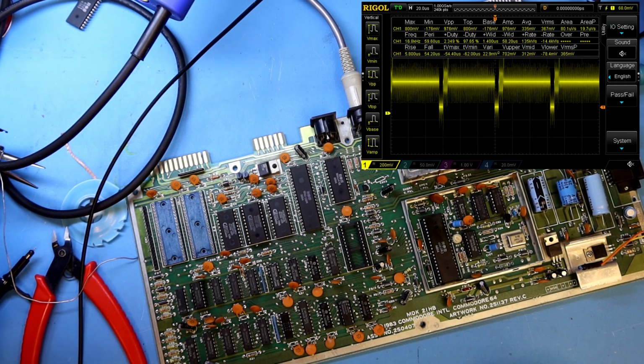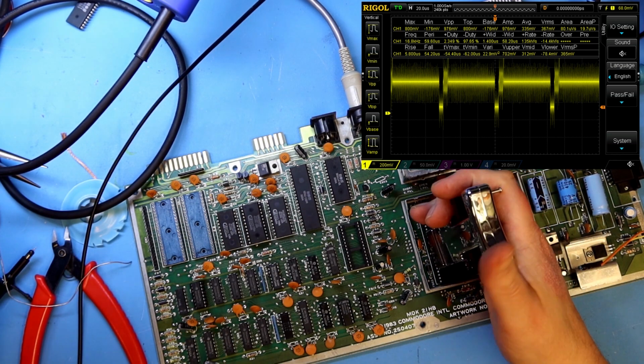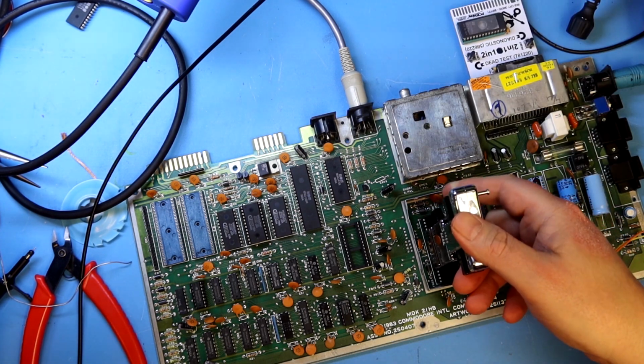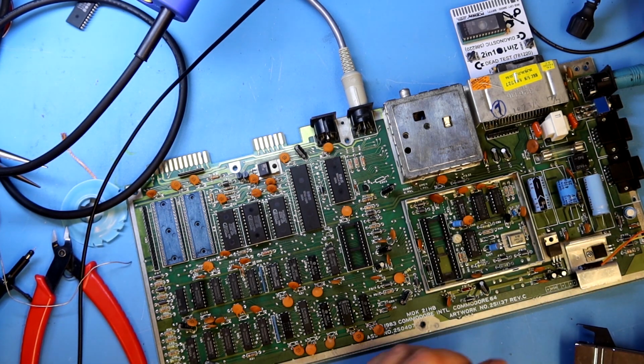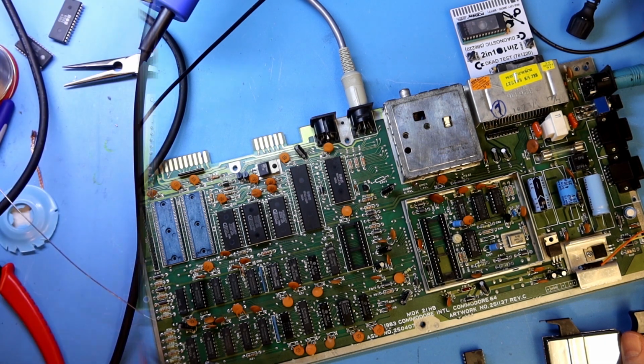Even though the screen is black, it still is producing a video signal, and I did probe for a video signal and it looks okay, but we are still going to test the VIC-II chip in the SixtyClone board to see if that works, and we might also desolder some of the other chips that are addressing the address lines. In fact, every one of the major chips on the system is connected to the address lines, so we will have to desolder more chips eventually to see what's causing this clog up.